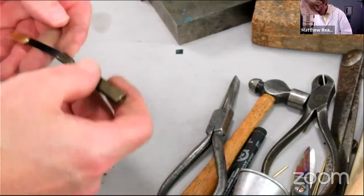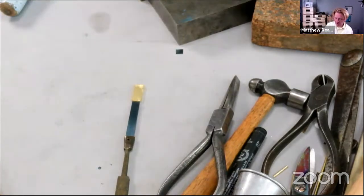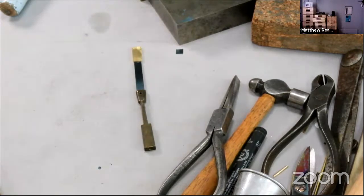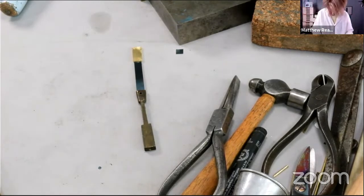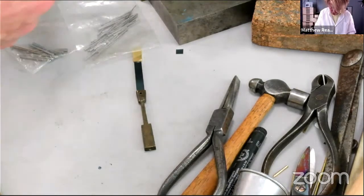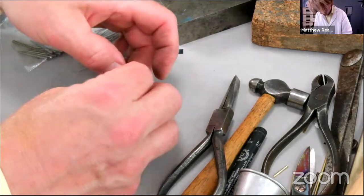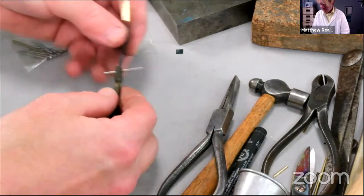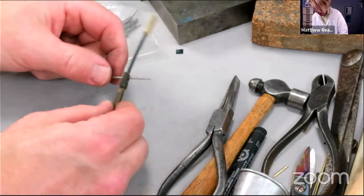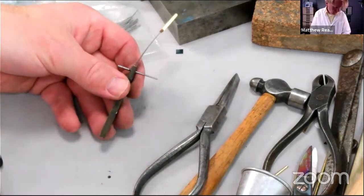So now we want our pin through here. And you remember me banging on about not riveting the pin. Don't rivet the pin. Just put a pin through there. That's a good fit. Just use one of our so-called universal pins. Yeah, that'll work well. But what we don't want here is a tapered pin. We want this pin to be parallel where it goes through, or nearly parallel anyway. So let's just put a bit of a mark. We know where that wants to be.